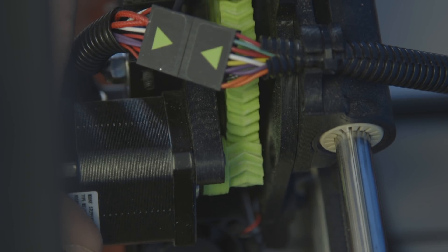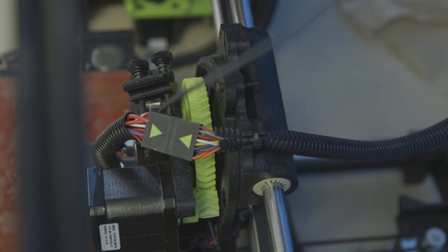Now within these categories there's one subcategory: direct and geared extruders. With direct extruders there is a gear on the motor shaft and this is the one that interacts with the filament. With geared extruders there is a gear on the motor shaft connected to another gear, and that second one is the one that interfaces with the filament. Geared setups can work with 1.75mm or 3mm filament very easily, but with direct you don't get enough torque to push 3mm filament. It can do 1.75mm no problem, but 3mm requires a lot of torque — which is why you see the Wades extruder on a Lulzbot, which has a small gear on the motor and a big gear attached to the hob bolt.